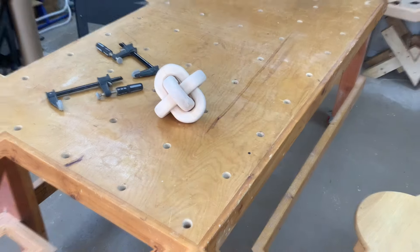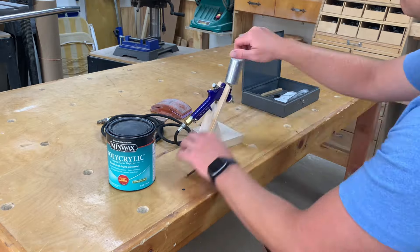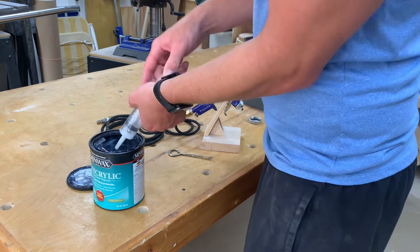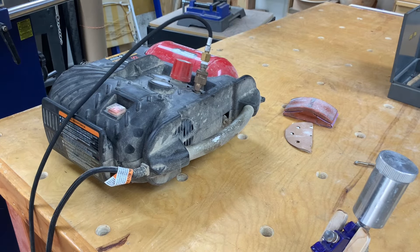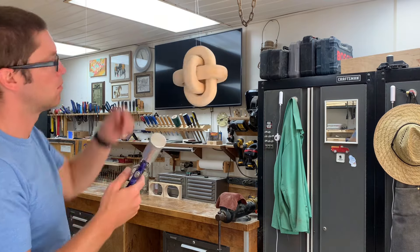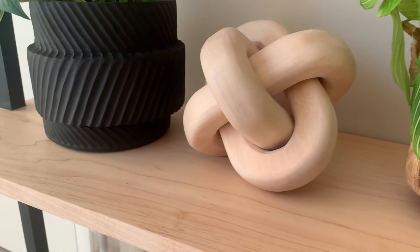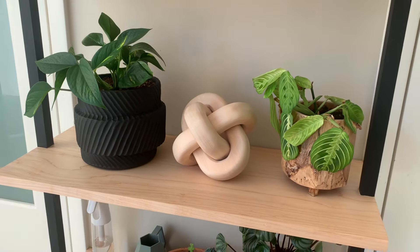Left it in the clamps for a day or so, took them apart, and it doesn't look too bad. Before we can call it done, we need to put a finish on it. This is just a polycrylic - it's a flat so it's not going to have any sheen to it, but it does help, and my wife claims it also makes dusting easier. We hooked the spray gun up to the air compressor and gave it a nice even coat all the way around, also getting inside the inner parts. We want to make it look like a glazed doughnut - look at that shine! But whenever it dries it'll be flat. If you've made it this far, we really appreciate you watching. Like and subscribe - there's going to be plenty more. Thanks for watching and God bless!